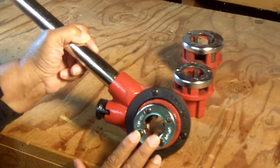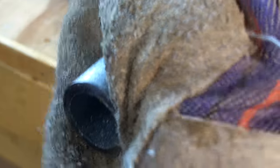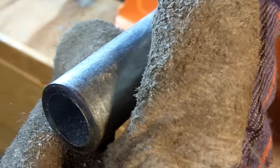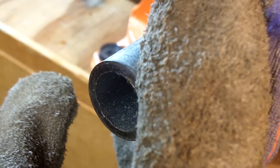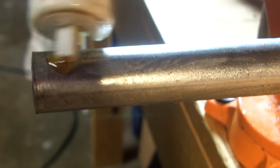I've got my pipe in the vise — it's very secure. I'm wearing gloves because it gets a little messy since you have to use cutting oil. The oil lubricates the pipe, but most importantly it lubricates the teeth on the die, keeping it lasting a long time. Without lubrication, there's wear and tear on the die and it won't last as long.